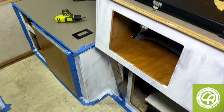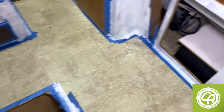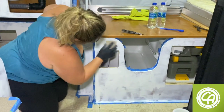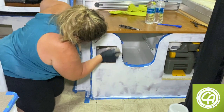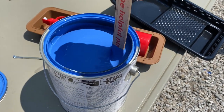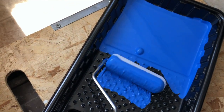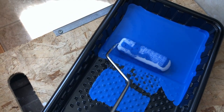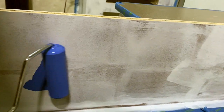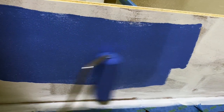We used both a brush and a four-inch foam roller designed specifically for cabinets and counters. After that we did a light sand to create a smooth surface so brush strokes didn't show up. Morgan selected a gorgeous blue from Valspar — the cabinet and furniture semi-gloss. It does a really good job of covering. Just like with primer, the first coat doesn't need to be perfect; focus on good coverage, smoothness, and use both the foam roller and a brush to touch it up.